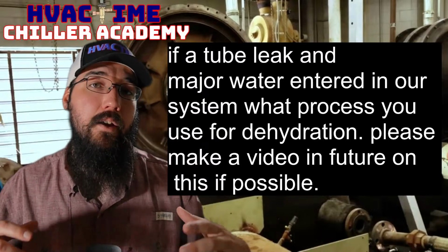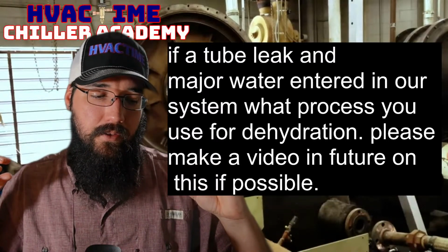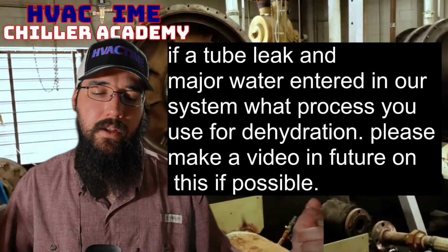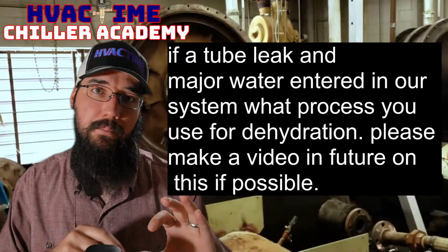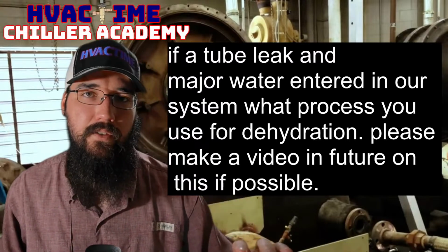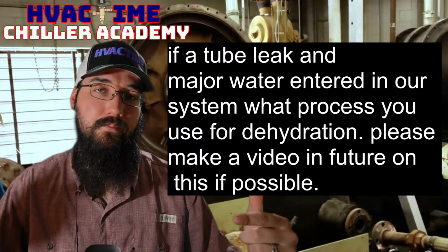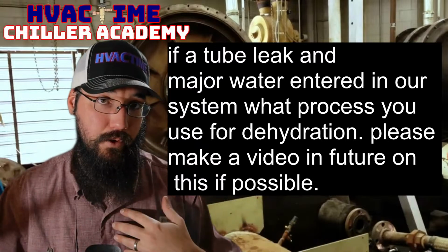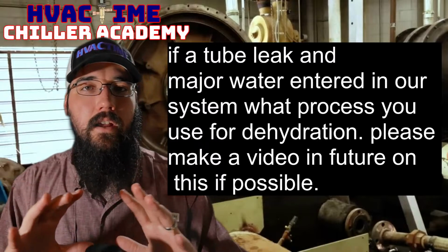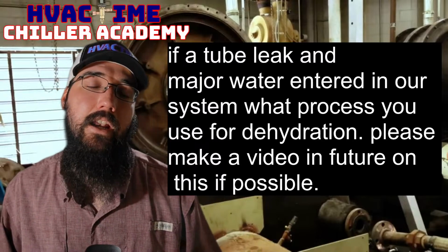Now, if you caught the leak prior to it completely rupturing, where you say you caught it through an eddy current or something, then you can plug the actual holes, which is getting a plug and putting some refrigerant sealer. One I like in a case like that would be, say, 515. Put that on your plug, shove that into the tube on either side. I personally prefer to clear the line out of water as much as I can ahead of time, try to dehydrate it. So if it's not too bad, you can do that. Then you get stuck with mitigating what water got into it.